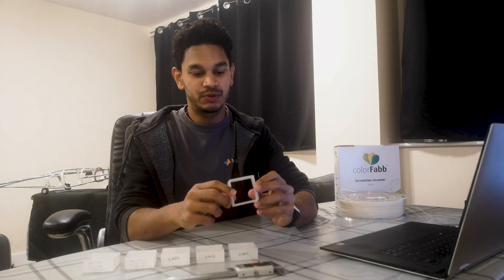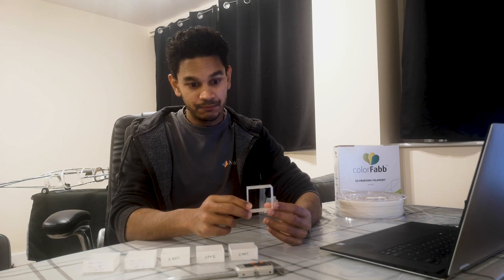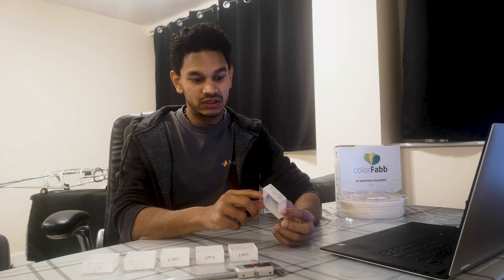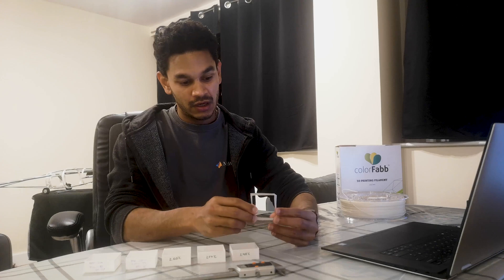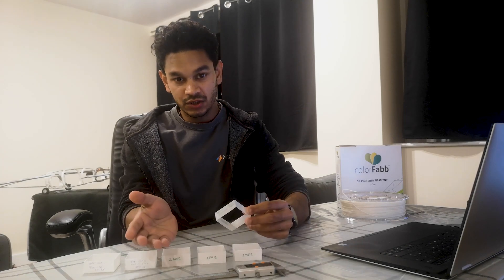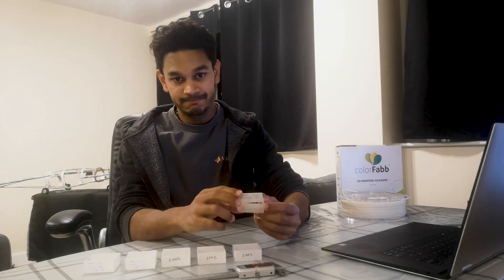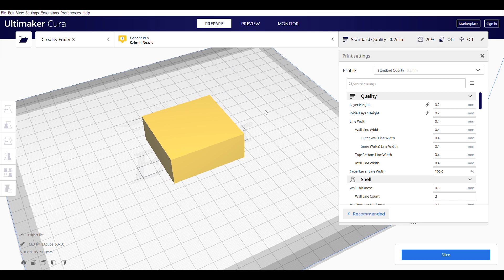The first cube you're going to print at 200 degrees Celsius. You want to fix the print speed throughout the entire calibration — I set mine at 35 mm/s. The tutorial suggests 25 mm/s for more expansion, and you can go up to around 45 mm/s, but 35 was a good compromise. In your CAD tool, go ahead and make a solid cube and bring it into Cura.